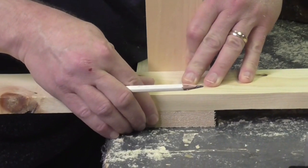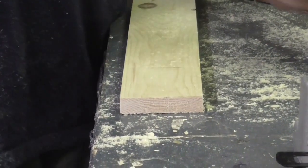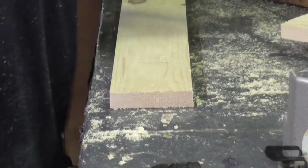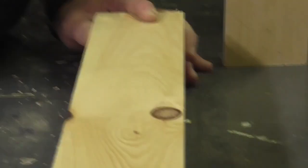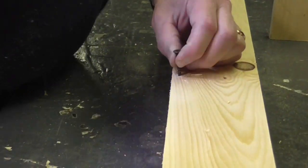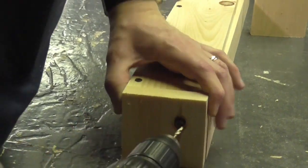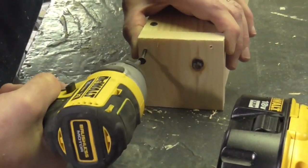Cut the edges of the tray so they are as wide as the bottom and as tall as the sides. We ended up making the edges of the tray too tall, so we cut them down to the right size later. Drill pilot holes into the tray to avoid splitting the wood and use screws to attach each side together. Make sure you place your screws so that they don't hit each other when you attach the bottom and the sides.